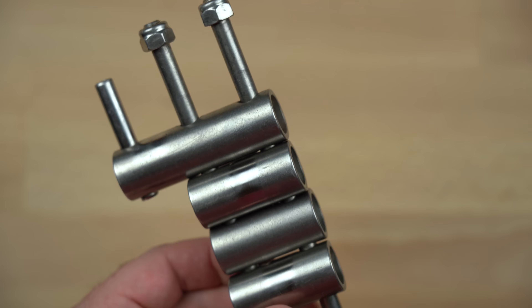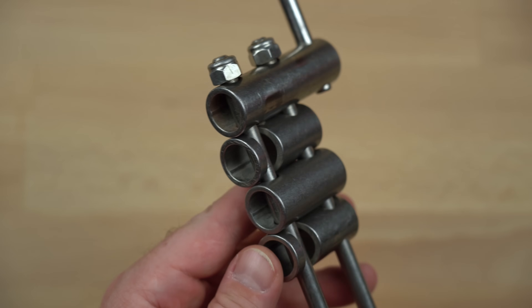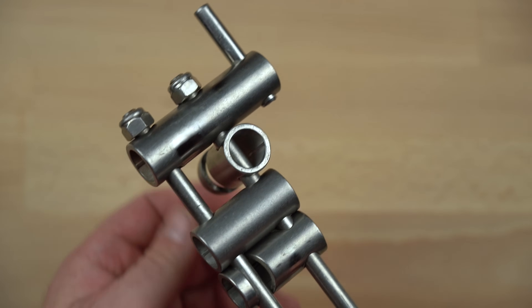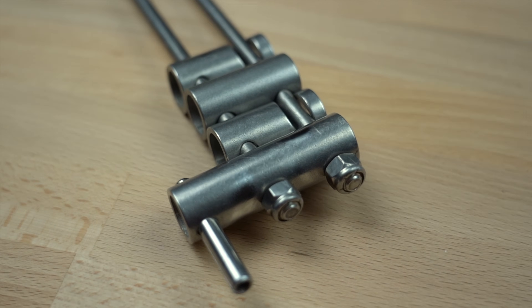To flip a hyperbar, you'll need to use a hammer and vise to reverse the pin, which is held in place by friction. The frame shouldn't see significant wear, but it should be inspected periodically for damage or sharp edges. Check that the nylon lock nuts are tightened such that at least one row of threads is visible above the top of the nut.